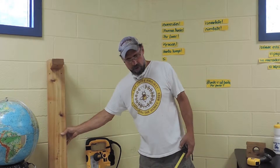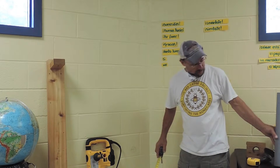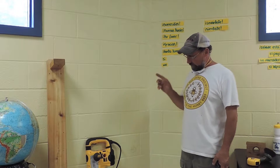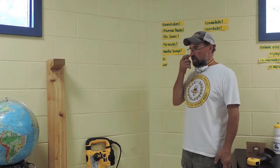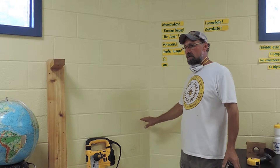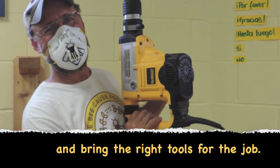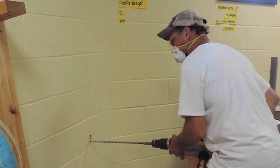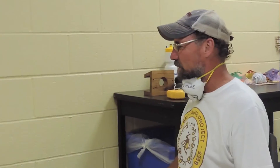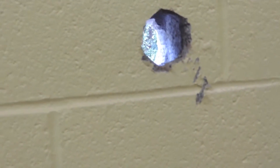The pipe that goes through the wall is inch-and-a-half conduit, so you need a two-inch hole. I'm going to drill it a little bit big. In a basement you never know what you're going to get, but you'll probably need a hammer drill — you could do it with another drill but it will take some time. The main thing is you want to make sure the hole has a little bit of slope to it so that any water or condensation that gets in there will drain out.